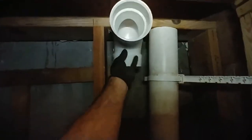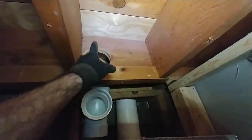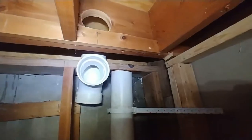When we get over here, we'll use this sanitary tee, and this is the sewer line going down and the stack going up. I just want to be in here and coming out through that hole, and then we'll come through here, we'll do a big elbow and we'll go over there. Now as we go, we're going downhill a quarter inch a foot or so. And to do that, I'm just using the distance between the top of the hole and the subfloor. To do about 2 feet here, we're at a quarter to a half an inch greater distance there, and we just keep going like that.